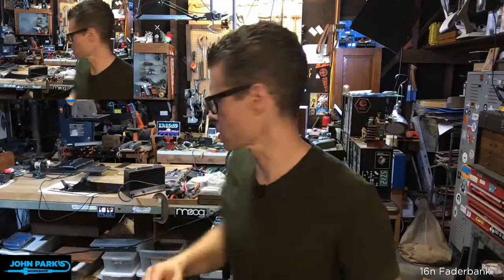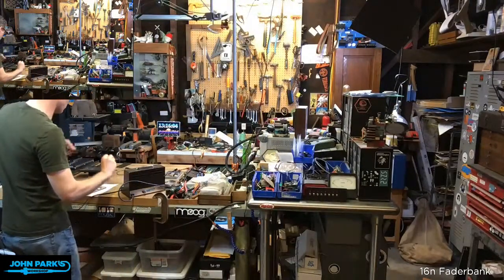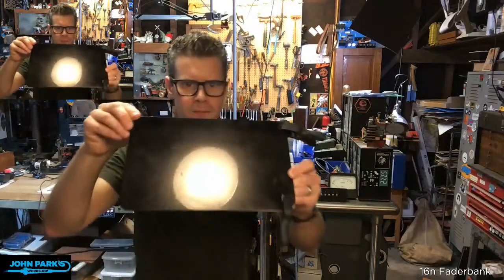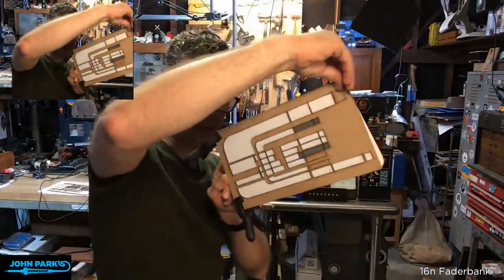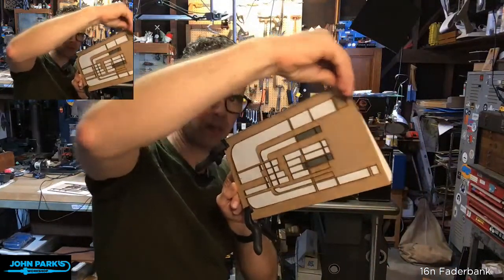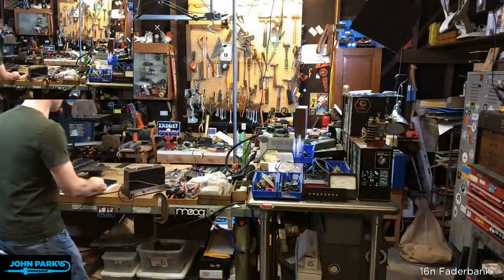I am taking another pass at using an LED matrix for it, except I've decided I'm going to use a pair of our 2.5 millimeter pitch 64 by 64 panels. I want to get denser so that I don't get fuzzy edges on the LCARS panel. If you're wondering what I'm talking about, it's this Star Trek display, which is backlit, which is why you can't see it very well right here. I have my little light blockers, and I have in there a couple of pieces of polarizing film.